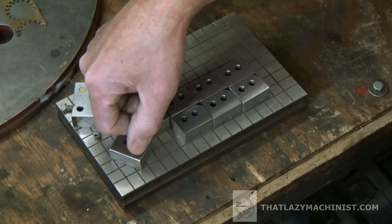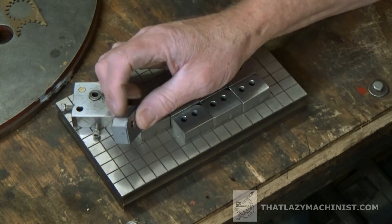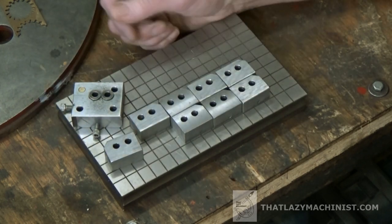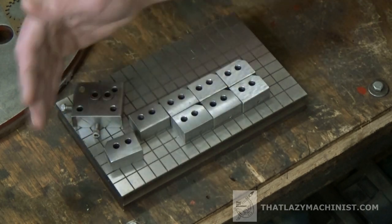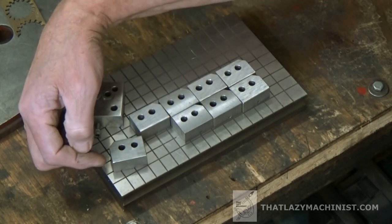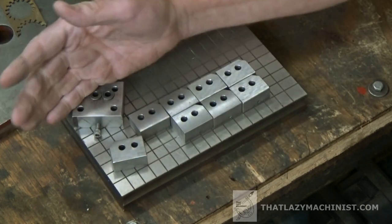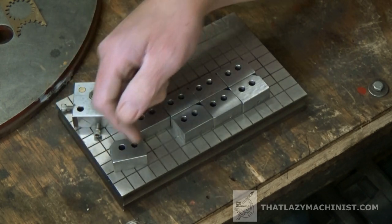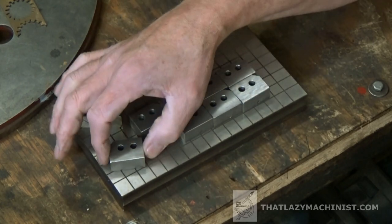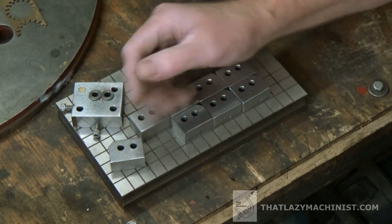And well, I want to mill a mirrored flat from this one. So this is one flat that we produce at the very start, and you may be wondering, why didn't you just produce the other one at the same time? We could have done that, but since I planned this through before I started cutting anything, I realized that when I do my through hole here, I'll be exiting an angular surface. So drilling into an angular surface or exiting a hole through an angular surface is really not a good situation. So it will be far easier to produce the hole and mill that surface later.